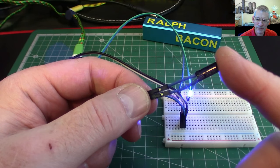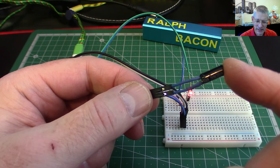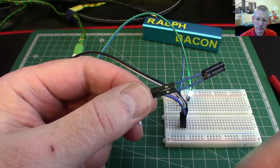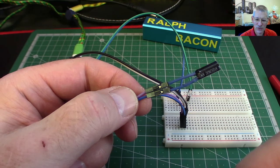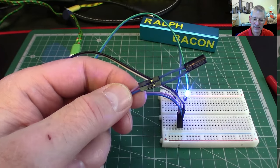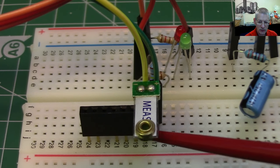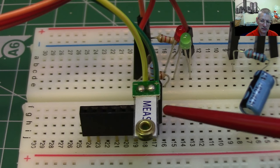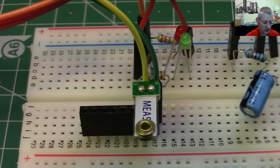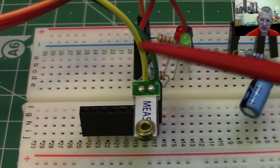Yes, there is a better way — a bespoke vibration detector. We'll also look at a new feature that appeared in Arduino IDE 1.6.6: the serial plotter. Now here we have it — this little device is a bespoke piezo vibration detector. In the same way that you can send a voltage square wave to a piezo transducer and it makes a sound, if this receives vibrations it will generate a voltage back up the two wires and you can detect them.